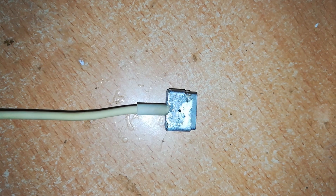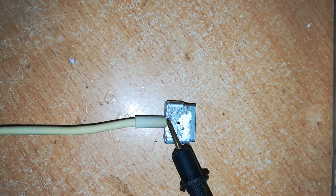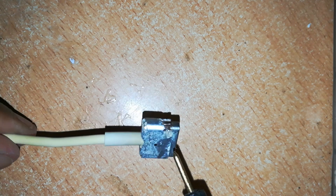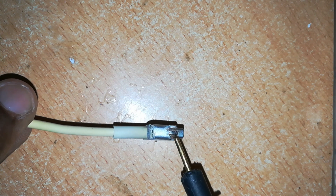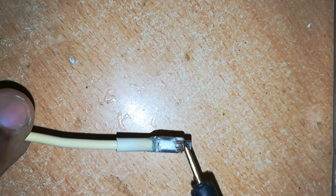This other side intrigues me most because it's like it's eaten all the way through, and still it's showing that it is charging this MacBook. Now let's clean it up and see how it looks, and if it's still working we'll be able to see it. With a bit of cleaning you can see the damage more clearly — it's been eaten up at that point. The top of this casing has been corroded, and here we have an interesting feature: this clip which holds the casing inside. This is what makes MagSafe 2 connectors very difficult — almost impossible — to open.